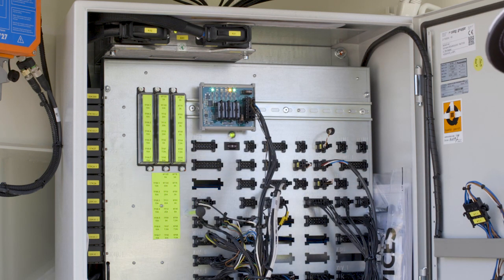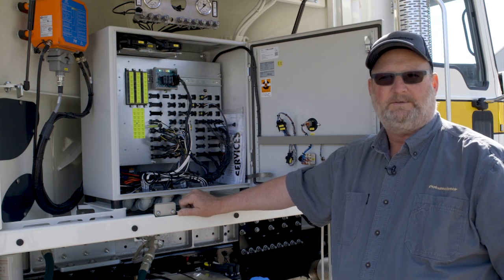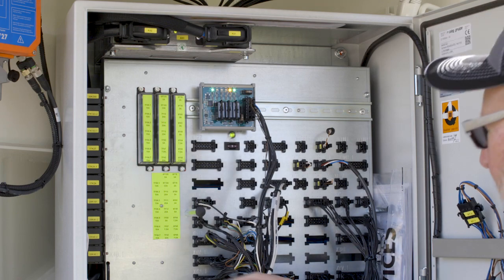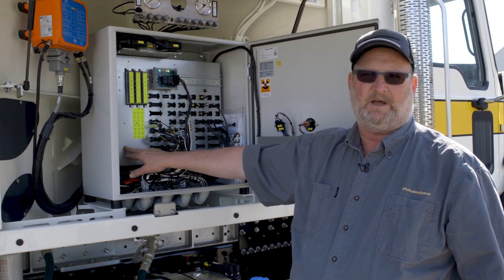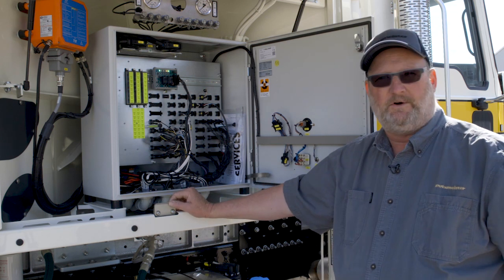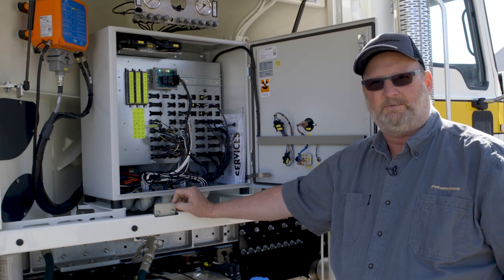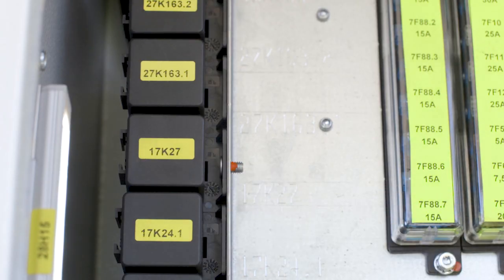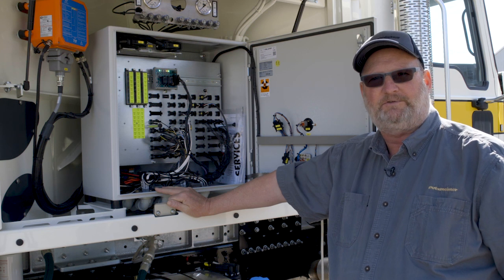This component here is our boom rest safety switch — a system that alerts the operator if he tries to drive the truck with the boom not properly stowed. The backplane is basically just a plug-in terminal strip. All throughout the backplane, all plug-ins, fuses, and relays are numbered to help with troubleshooting problems down in the future. The labeling throughout the system really helps mechanics troubleshoot. For example, 17K27 tells you exactly what page of the schematic you'll find it on and what that relay does. It really aids in troubleshooting.